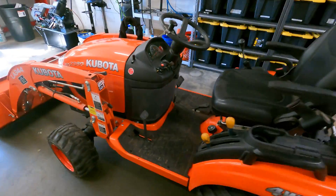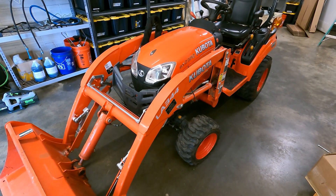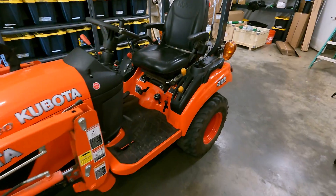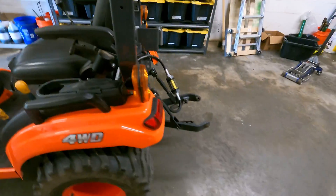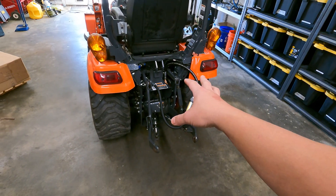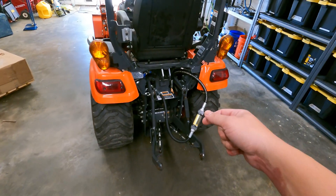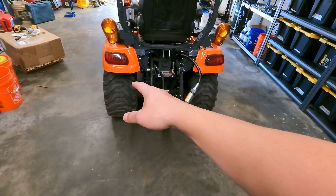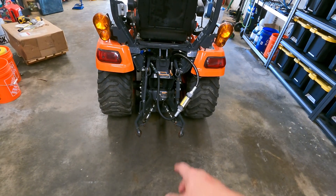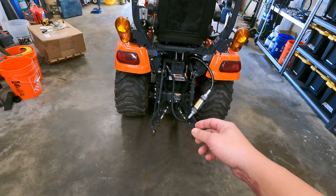Now with the John Deere, with what we do, I'd say you get between five and five and a half gallons per minute, depending on exactly how you tune it. The John Deere pump, according to the specs we have, would put out more than this pump — at least according to tractordata. We're about to check and see what we can get for this pump with all flow going through one direction, and we'll see if it's much different or the same. Let me get this tire off and we'll have a look at this together.